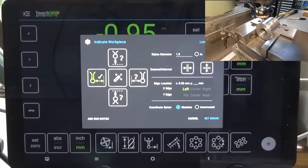I used this a fair bit yesterday on a machining operation, and I just love the way that it works. The old handle, you really have to struggle to get it off the quill shaft extension, reposition it, and then bump it back on again to try to find the annular groove with the ball detent. And it was just a bit frustrating and annoying, but this just works seamlessly. Absolutely love it. Okay, well, thank you for watching today.